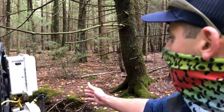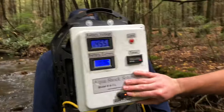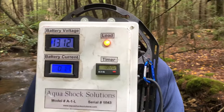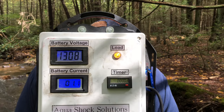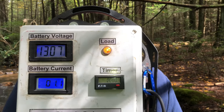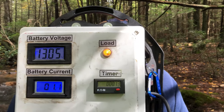I'm going to start turning on the pack and finishing the setup. I have the correct voltage selected, I have the correct amperage being put into the water, and I'm going to make sure that I reset the timer so we can use a catch-per-unit-effort and know how much time we've actually spent in our electrofishing survey for a biomass estimate.